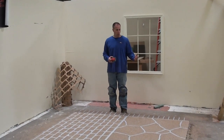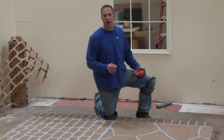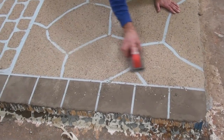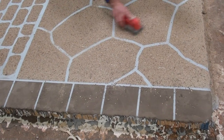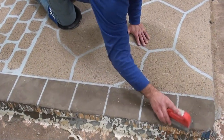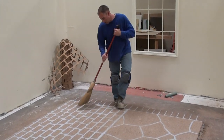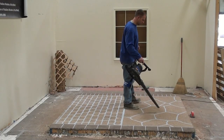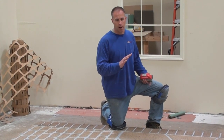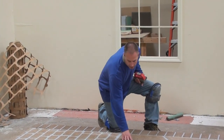Our slab is dried out now. With the spray mix there are a lot of high and low spots — it's pretty rough, and those high points are actually weak points in the spray mix. By taking a rubstone and rubbing off the top, you achieve two things: it gives you material for a repair kit, and it also takes off the weakest points of the overlay. Once we're done rubbing it down, we'll sweep and blow off the project. This gives us a surface that's well prepared to handle foot traffic, light vehicular traffic, plastic and aluminum snow shovels, and normal wear and tear much better than if we left it rough and sealed it.